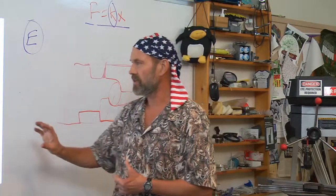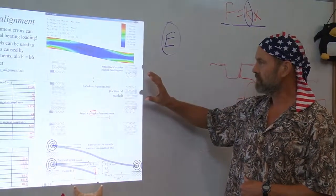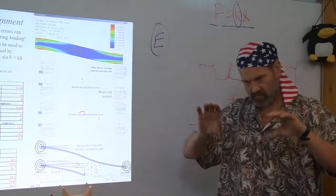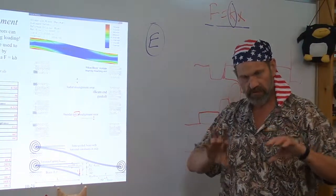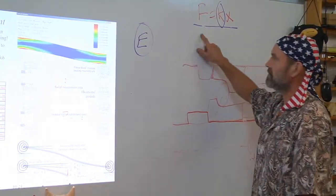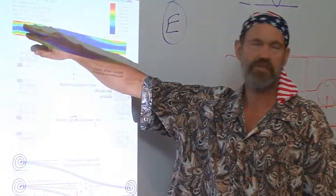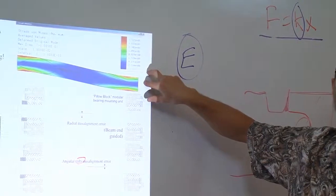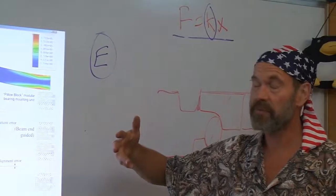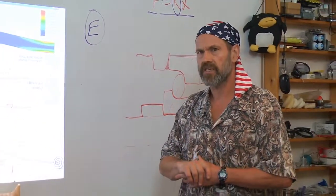The text has some very nice spreadsheets where it will allow you to calculate the load that is on a shaft, for example, by the bearings being misaligned radially and actually tilt, and then give you a number for what this force is. In these pretty colors, you can then go and check some of your machine configurations with finite element analysis in the end to verify your assumptions or correct your making a proper model of what the stiffness of the housing was, which is often the most difficult thing to predict.